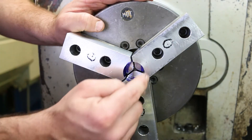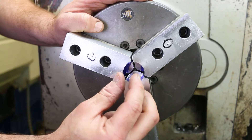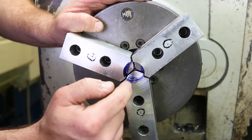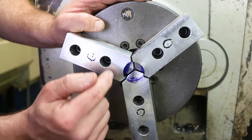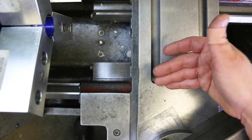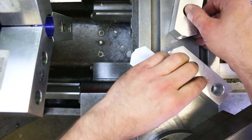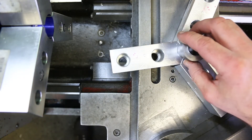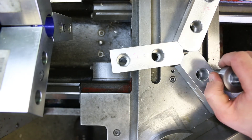Think about what this is right now — it's three separate arcs which used to be part of one continuous diameter, but now we've moved them in closer. So it's now like three lobes rather than a true diameter. When we go in to take a cut, it's not going to clean up everywhere on those surfaces at once. A quick way to check that your soft jaws have enough material to clean up to fit your part is to take those jaws loosely and put them together in their most closed position. If your part can fit between the jaws, then too much material has already been removed and you can't use them for this part. So this one would be good — these look like they've only had about one cut on them.